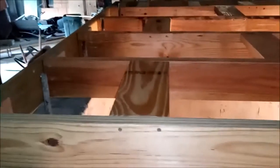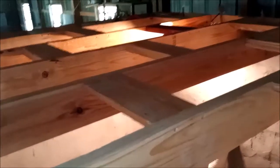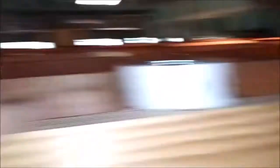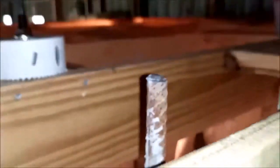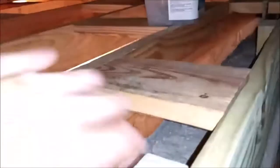This is a couple days after putting the Quick Wall on — it's curing nicely. Now I've put the flat roof rafters on and I'm putting in the cross braces — very simple. I'm going to knock down this rebar a little bit since I'm only going 10 rows instead of 11. I can't put the plywood on the roof until the rebar is trimmed, then I'll put 3/4-inch plywood, then 5/8-inch cement board on top of that. I'm going to bring the cement board over the side too, so I can Quick Wall the whole sides.